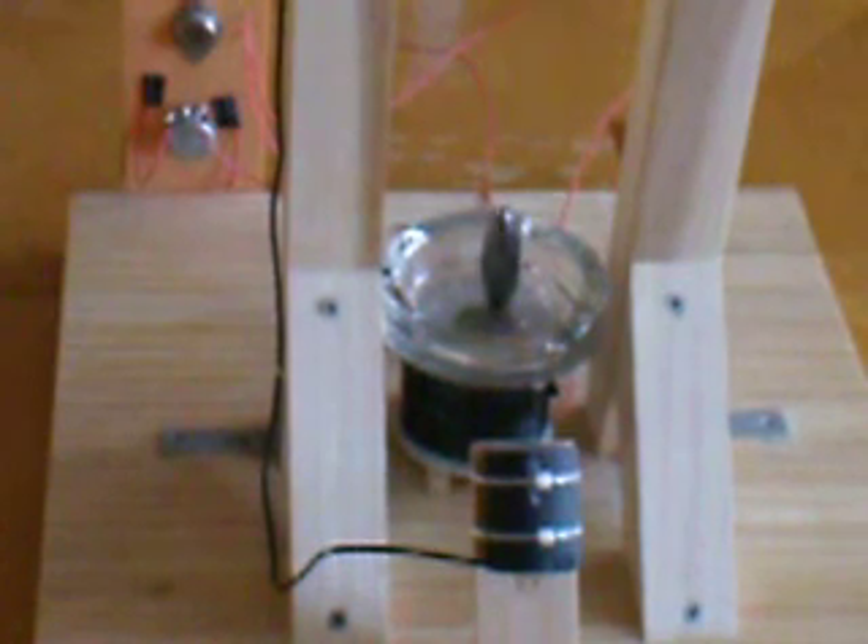I have attached my multimeter to the output lead. Sorry for the awkward camera work here. The output, based on the 6-volt input, is 5.33 to 5.32 volts. That's the charging amount that's going into the charging battery, which is right there. The other battery — the Rayovac — is the power battery.